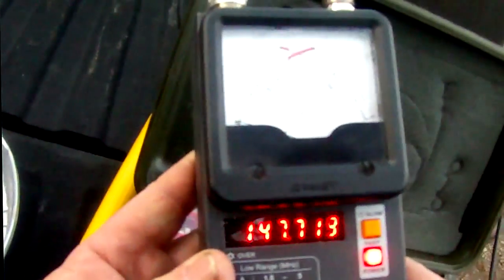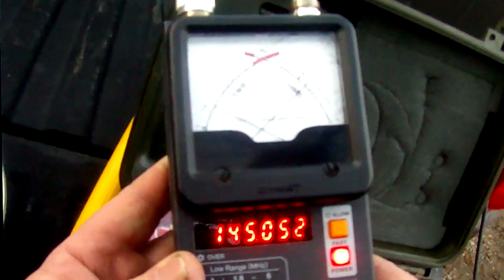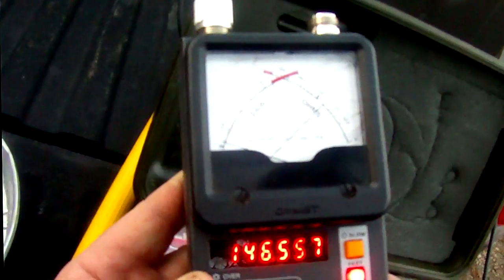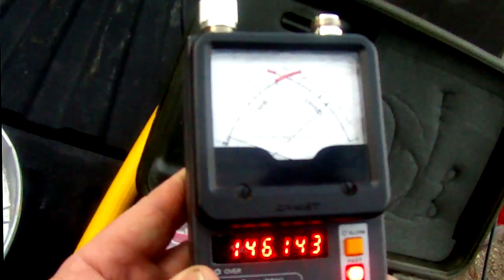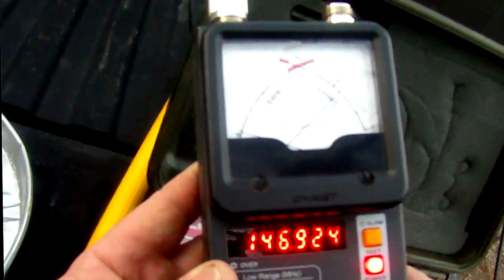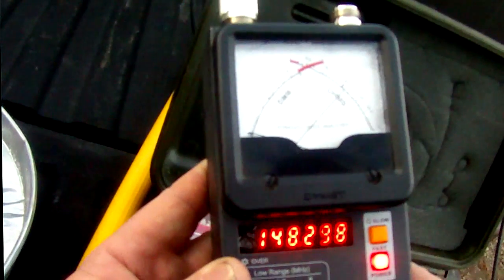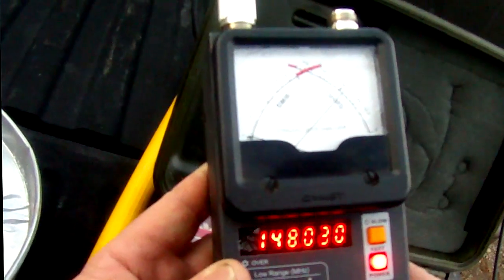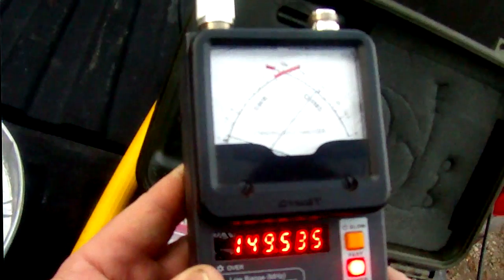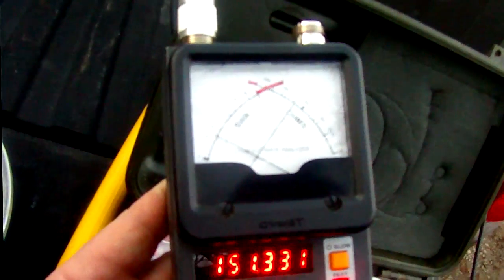Is that perfect resonance? That's the best. That's perfect. Now we've gone down to at 140. Let's go to 5. You're about 1.7-to-1. That's not bad, is it? 1.6. Oops, I passed it. You're about 1.2, 147.0, you're a little over 1.1, 148, dead on, 149, you're close, 150, you get up to 1.2, got some range.